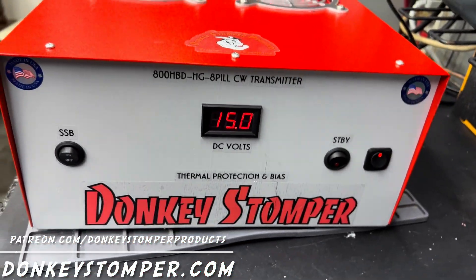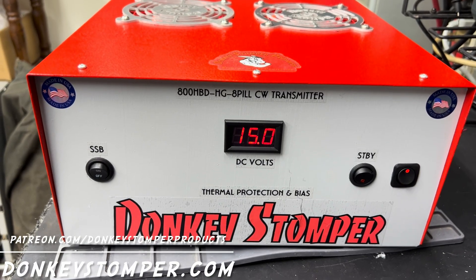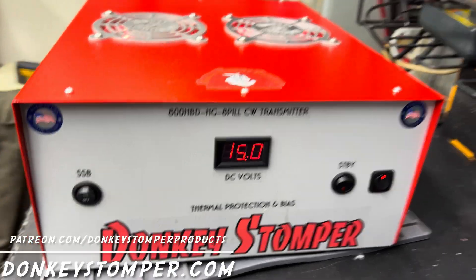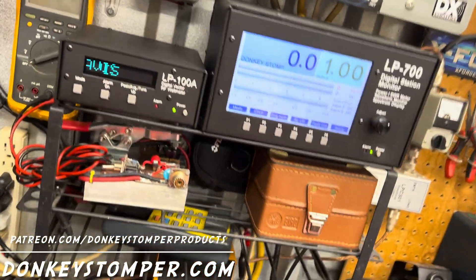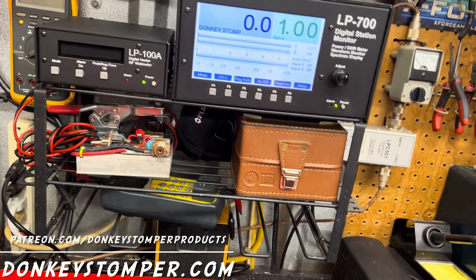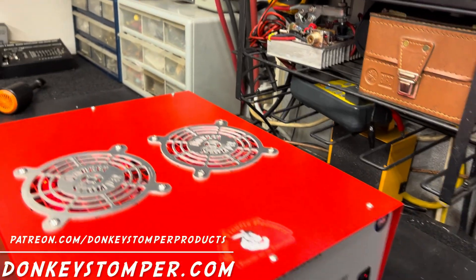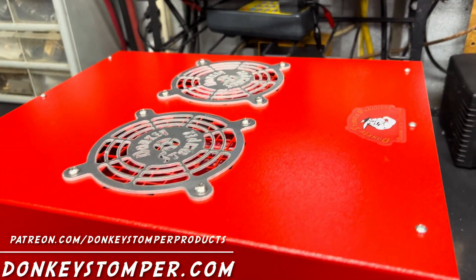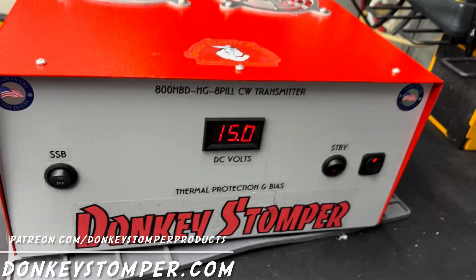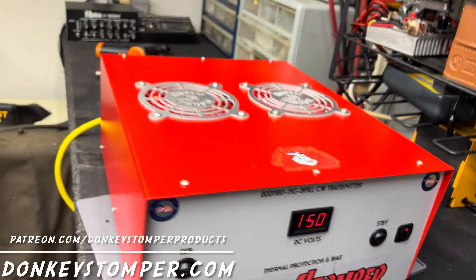There's been tons and tons of blown transistors on sideband. That's the way I've learned to run them so they won't blow. If you crank it up with the drive wide open because you ain't got no key and you start making 1,300 to 2,000 watts average out of an eight-pill, it's gonna blow a transistor real quick. I know I'm kind of country redneck and may not explain it textbook, but I'm just trying to tell you how to keep from blowing transistors.